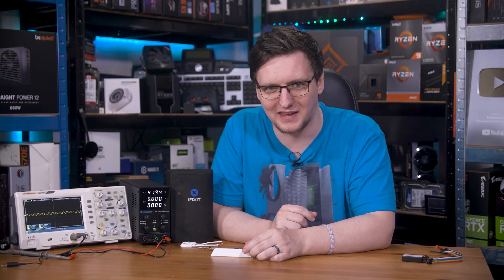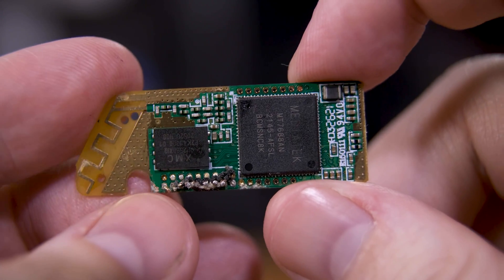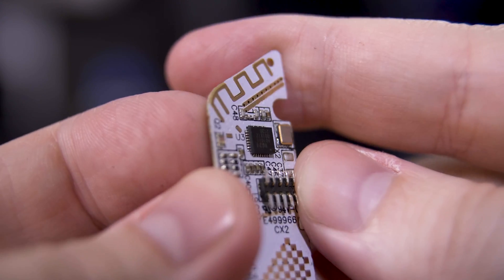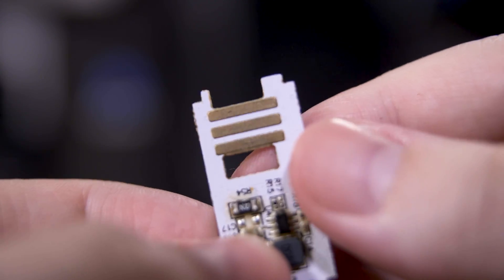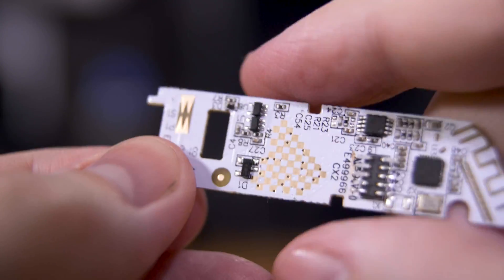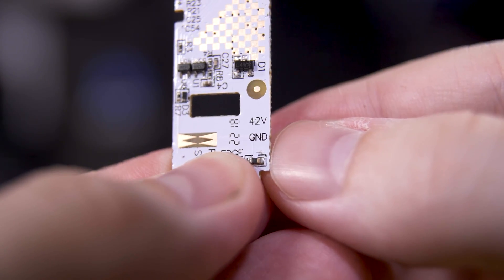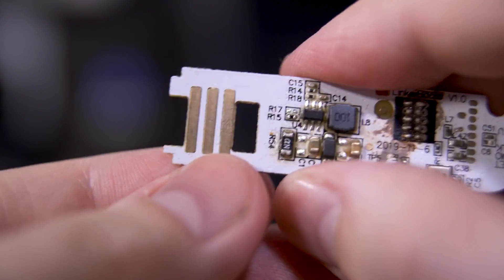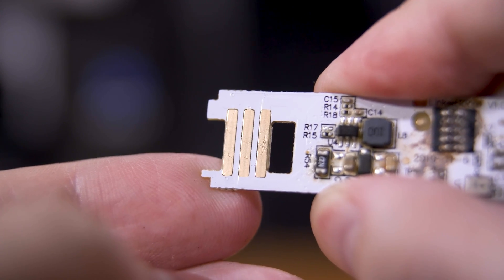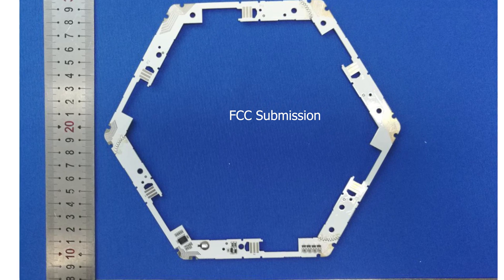This thing is remarkably complicated. There are three separate microcontrollers in here. One is a MediaTek MT7688AN, which runs OpenWRT and the Wi-Fi communications. There is also an EFR32MG21, which handles the BLE, Bluetooth Low Energy, and Thread communications, and also one EFM8BB10F8G microcontroller that does the communications with the panels and the little LEDs on the front. The panels themselves are powered by a 42 volt power supply, and there are only three pins to connect the controller and the panels together: power, ground, and signal.